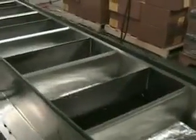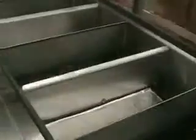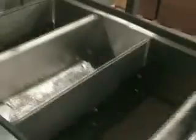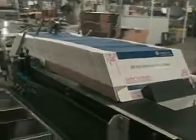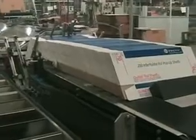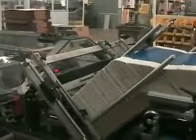We're going to walk down the system and point out some of the features. Here we have a 20-foot intermittent motion bucket conveyor to hold product. To minimize operator attendance, we have an extended powered magazine of about 5 feet. This allows you to stockpile cartons for the cartoner without constant attendance.